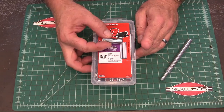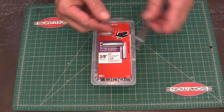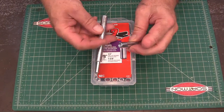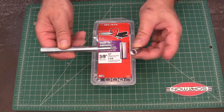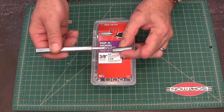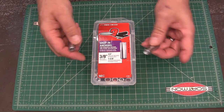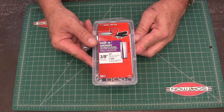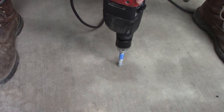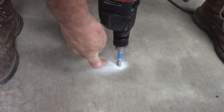So what you do is drill for these — it's a 3/8 anchor and you drill a half-inch hole. Then this is the little setting tool that you buy separately. You drive it once you get the anchor down in the hole — blow it out, get it good and clean, then set it in there and drive it down, and it wedges out and jams it in the hole.